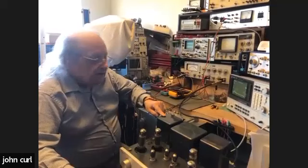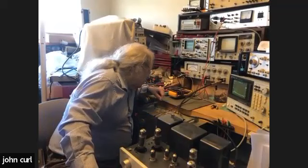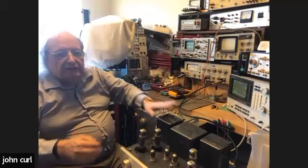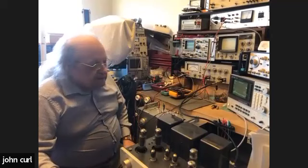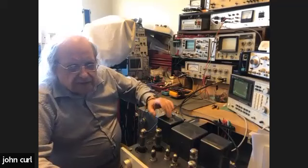Well, in order to overcome that and have the amp working within its best parameters, wouldn't it be best to have really efficient speakers? Well, yes. You wouldn't want to use this little amplifier with an 80 dB or 82 dB kind of speaker. It was never designed for that kind of thing. It would like 90-something dB probably at least, but 88 would be all right. A lot of the stuff this was designed for, and similar products like the old Marantz tube stuff, was very much like this.